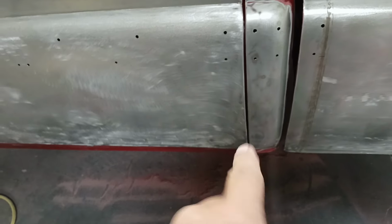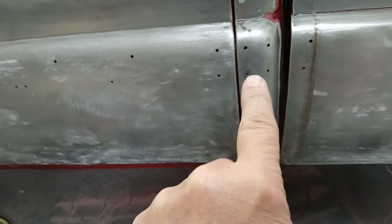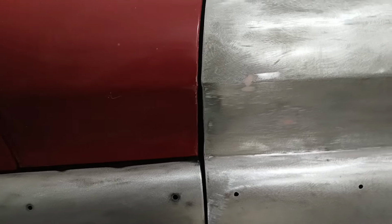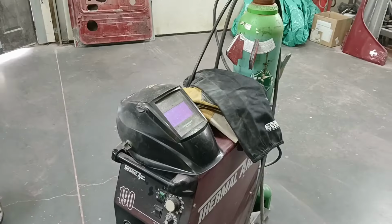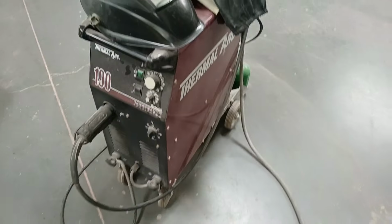I'll probably grind some off the edge of the door. Because again, that door was put on this truck new, and that's never moved, and it ain't rusty. So it's not a previous repair that's screwing us up. So you ain't fixing that gap with a wrench neither. That's the point of that. That's the meat and the whole sandwich here. So what do you do with that? To fix that? That's what you do with it. You take that and you marry it with that.